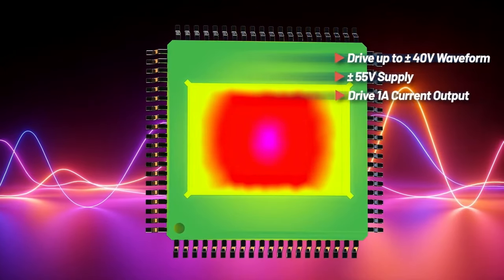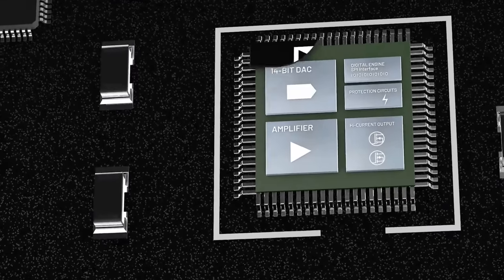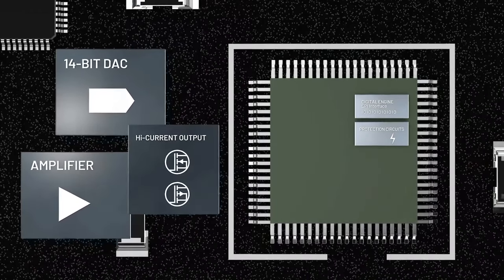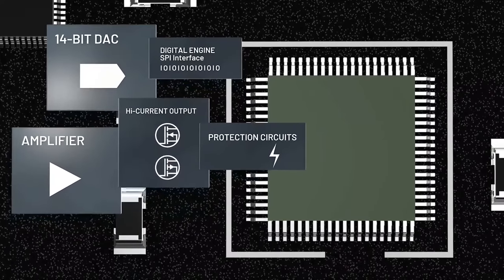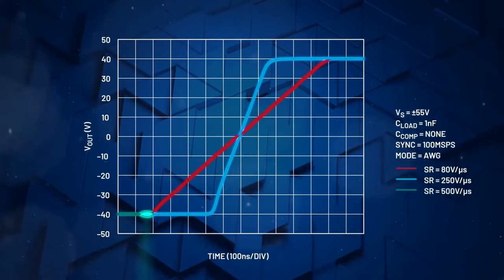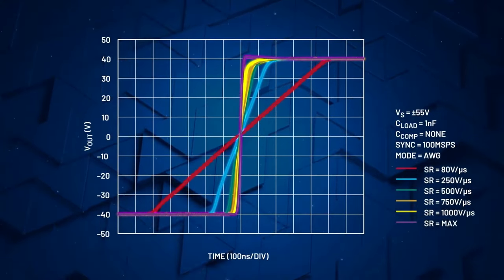The AD8460 combines efficiency and reliability into a power-dense package, offering superior design-in ease, configurability, and safety. The product is optimized for high power dissipation in a thermally efficient 12×12mm TQFP package with top-side exposed pad, allowing for mounting of a heatsink and thermal management. The AD8460 integrates a full signal chain: a 14-bit high-speed DAC, a novel high-voltage amplifier enabling precision and high-speed analog performance, an integrated high-power output stage, a digital engine for programmability, and analog protection features. The amplifier features slew boosting up to 1800 volts per microsecond, with output slew rate controllable digitally through edge speed control or with external compensation, enabling stable load drive and unlimited capacitive load drive.